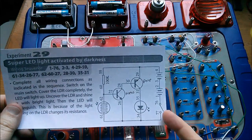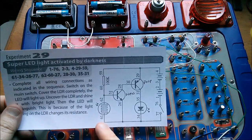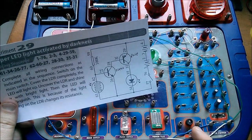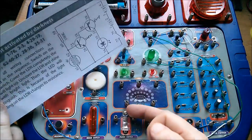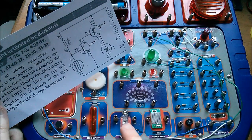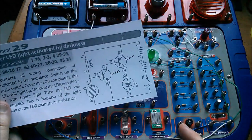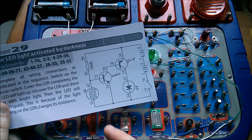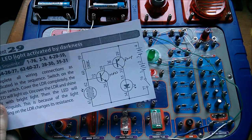This one's interesting — 77, which is the switched negative, also goes to the LDR, 61. But because this is a photodiode, they must have had to get these numbers the right way around, because an LDR — and I've actually put a little LDR there across this switch — it won't matter if I don't press the switch, so I can try it with an LDR instead of a photodiode. They must have got these numbers right so that the photodiode actually does something, because it probably won't do the same thing if it's in the reverse direction.